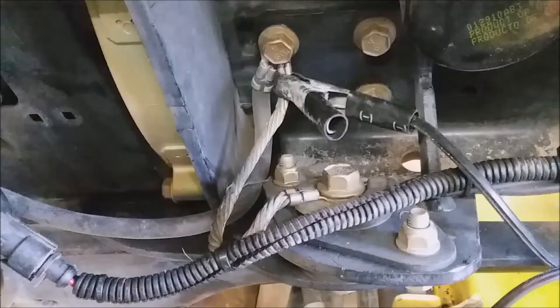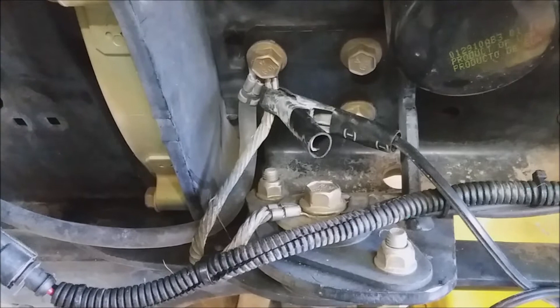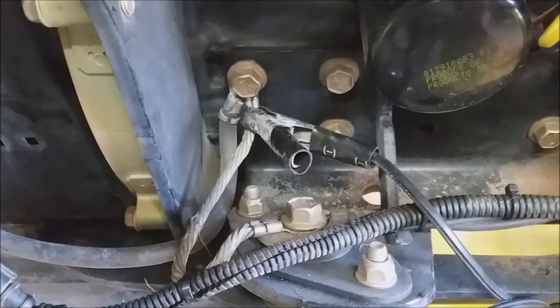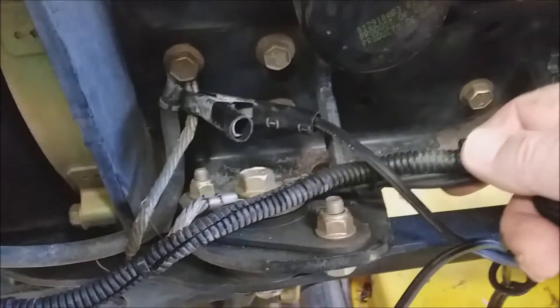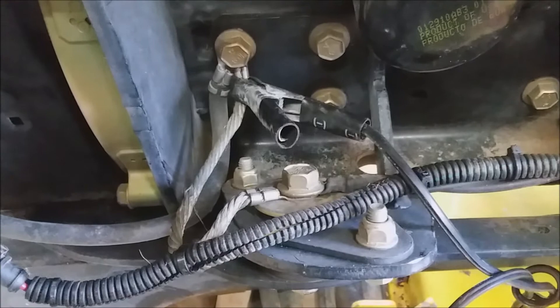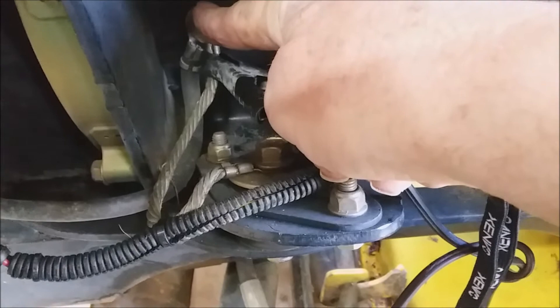When I say you need to ground that orange-white connector going back to the instrument cluster, I always like to run a jumper back to the battery ground rather than just touching it to something on the engine. On these tractors there is a ground connection coming from the instrument cluster that connects to a bolt on one of the motor mounts. A stranded wire then goes over to the engine block, and the ground cable from the battery also connects here — that's how the engine is grounded when you hit the starter.